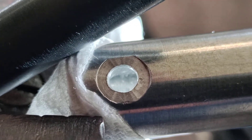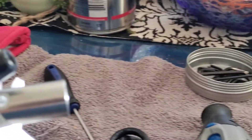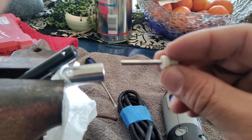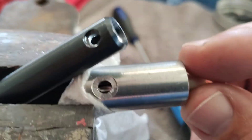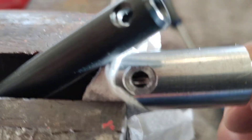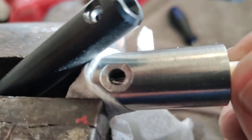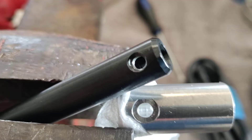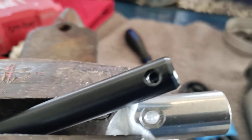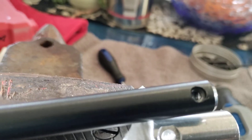Normally that's like a T and it does not flow like that. What this also does is it unshrouds this valve a ton. It's hard to see with the light but it's just completely unshrouded — you don't even need to remove material off the valve anymore. Inside the gun barrel where the transfer port is, I've radiused and rolled the inside of all of that.